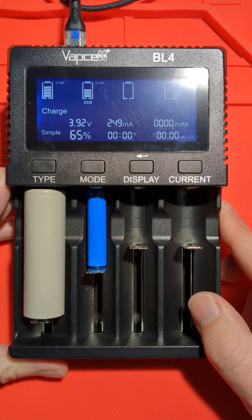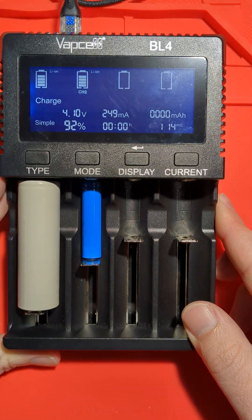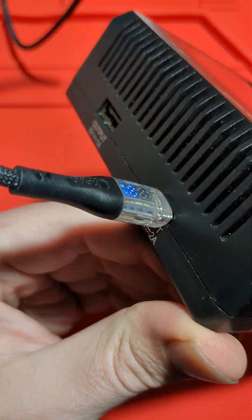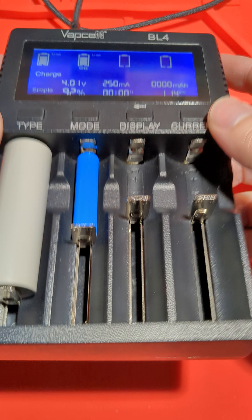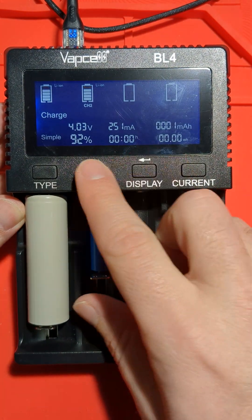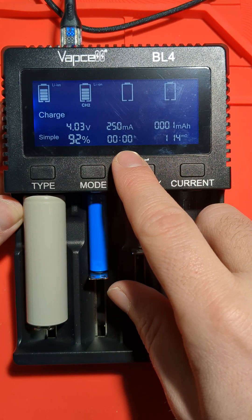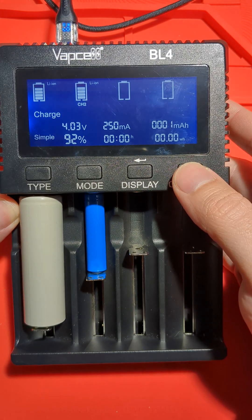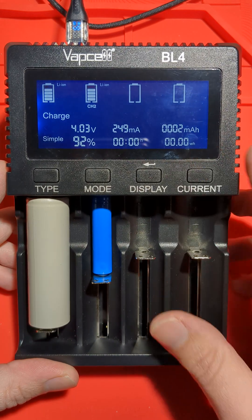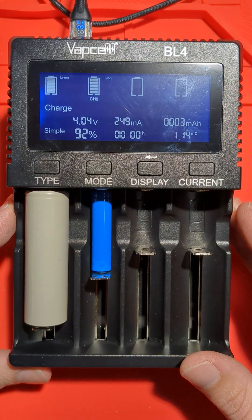That's a really quick introduction to the BL4. It's probably my favorite charger for small cells and it's great for different types of batteries. It has USB-C input, and it's also got USB-C output — though I'm probably never going to use that. There's a nice big display showing voltage, current, and capacity. It's also got the percentage of charge relative to 4.2V full, plus internal resistance measurement, and milliamp hours or watt hours. If you want to see my full review, check out the description below — I've got a blog with a comprehensive written review of this one.